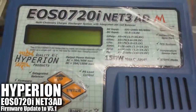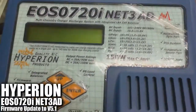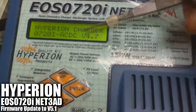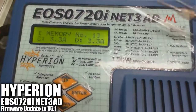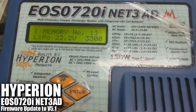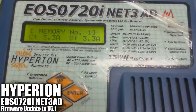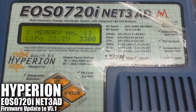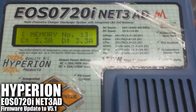For those who haven't updated, do it now. If you are on the charger, you should be able to see version 4.7 right here. This is the old version, so it is a good time for you to do the 5.1 upgrade. The reason is we have received feedback from some customers saying that version 4.7 no longer actually balances the cells properly. So it is a good time to do the 5.1 upgrade right now.